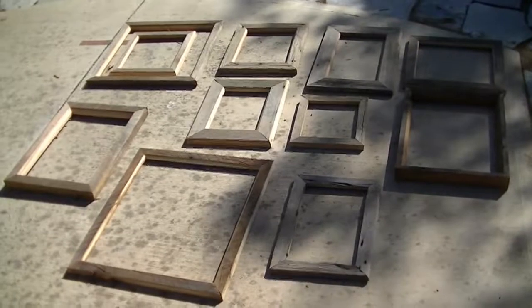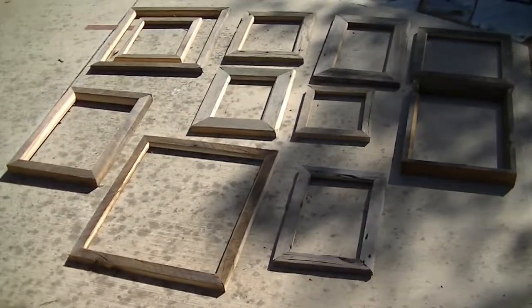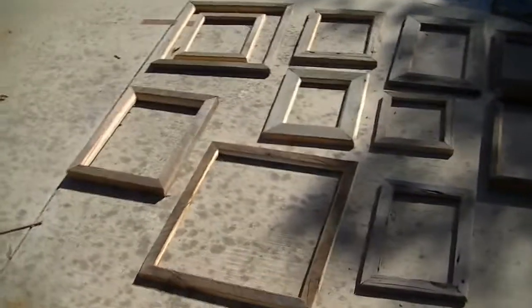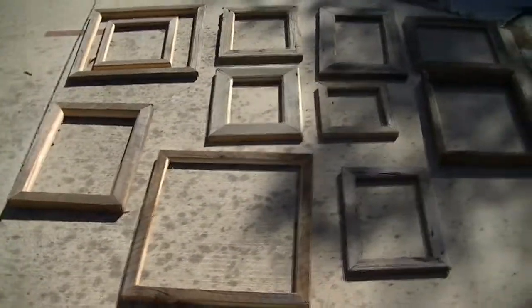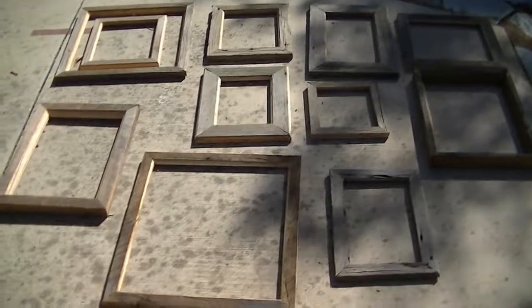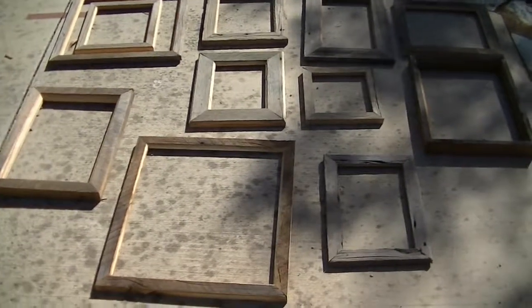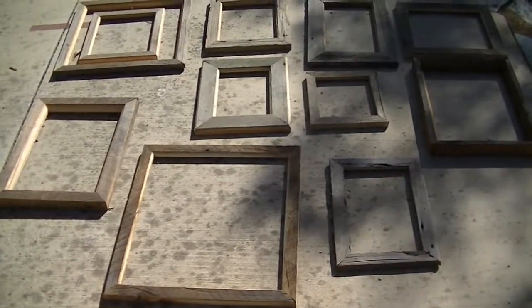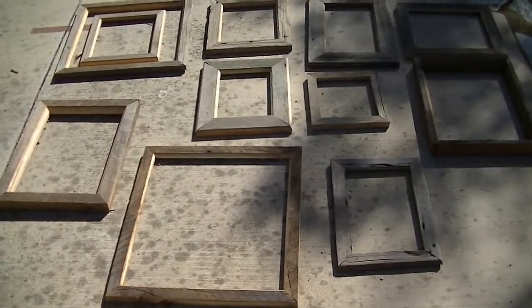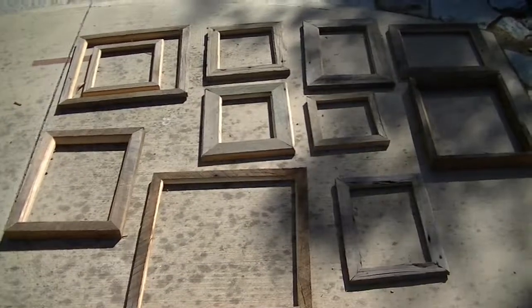We've finished off — I don't know, we got 12 of them, something like that. That's all for the day. What I'm going to do is let them sit and rest in the sun and the dry air for 24 hours or so to make sure that glue dries real good before I start messing around with them. Then the next step will be filling in the nail holes with wood dough, and after that sanding, then staining, and then the final coat of some matte lacquer.